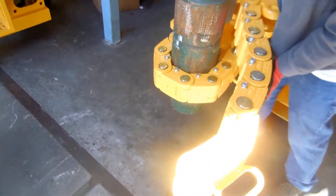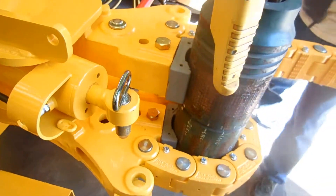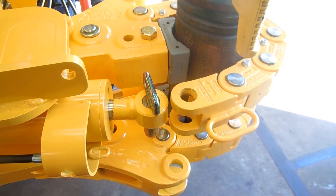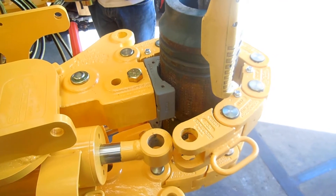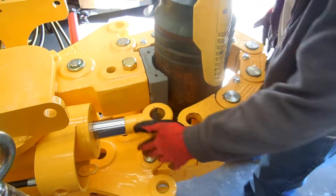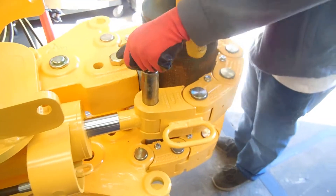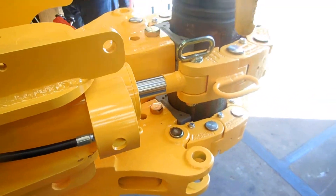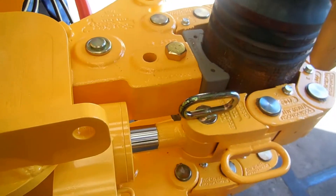It is now time to achieve grip using the top arm. The arm can be pushed over to align the jaw with the OD of the pipe. Watch for pinch points. The operator will extend the cylinder rod and secure the chain around the pipe, reinserting the pin and completing the grip.